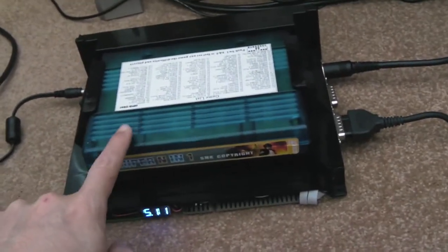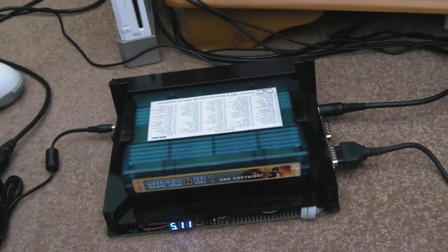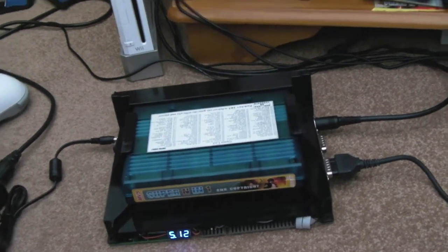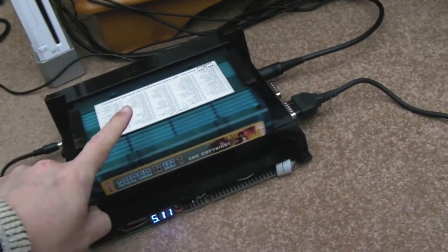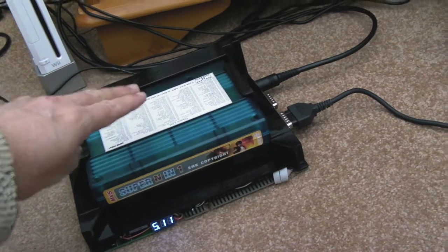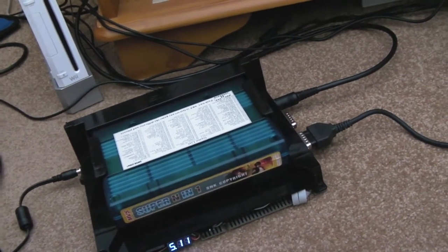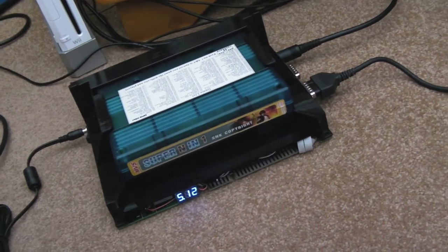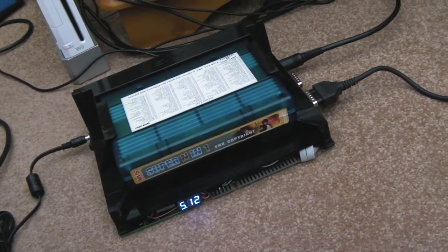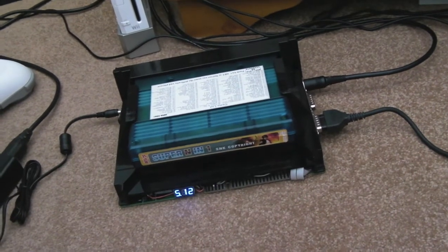The cart was still playing up intermittently since the last video where I thought I'd resolved it. I'd had a good look at a slightly suspect scratch across the board — definitely not the scratch. One of the things I did was take the two diodes out of one of the boards — the one containing the VROMs — and replaced them with a 3.3 volt 1 amp regulator. Since I did that work, I had no problems. Yesterday lunchtime I did the same for the character board, routing it all through one regulator with a single wire joining the two boards. It's been totally rock solid since.